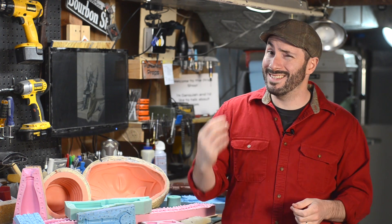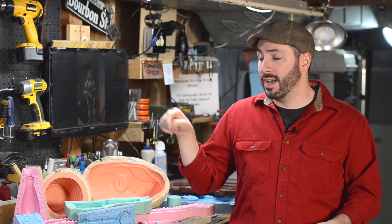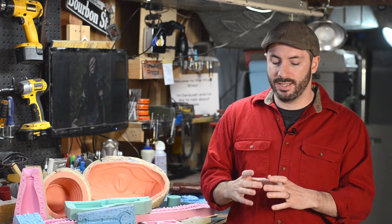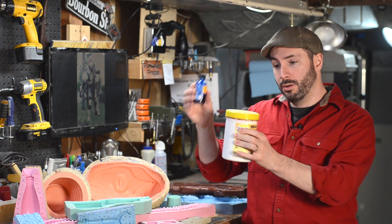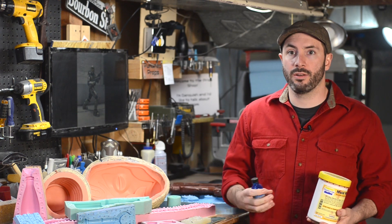I know what a bunch of you are going to say: Bill, that silicone ain't cheap. Why not just use silicone caulking to make molds? Well, you can do that — I've seen some hacks on how to make it more pliable. But silicone caulk is not designed to pull pieces out of; it's meant to be an adhesive. If you want to pull just one copy out, give it a go — but that's not how we do things around here. Learning how to use these materials properly is going to help you in the long run, especially if you start small. Work on projects that require just a little bit of silicone, learn the basics, then work your way up. You can even buy smaller trial-size kits — they're cheaper, and this amount of silicone is enough to knock out half a dozen smaller molds and really learn how the material works.